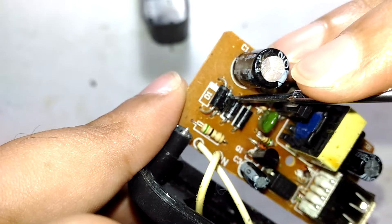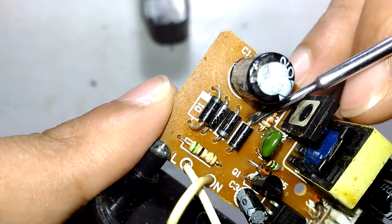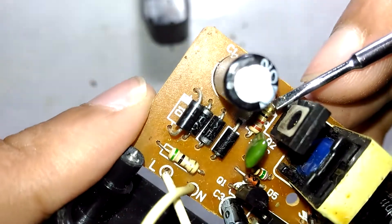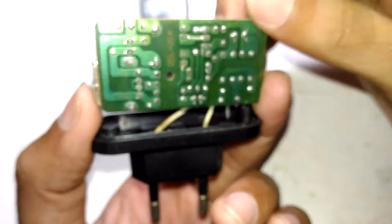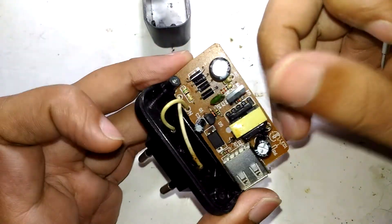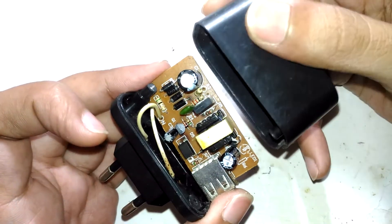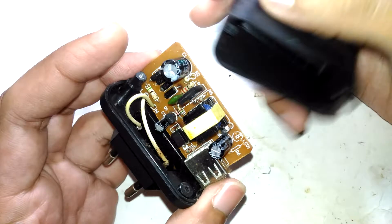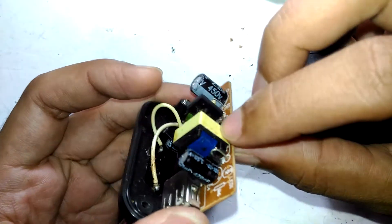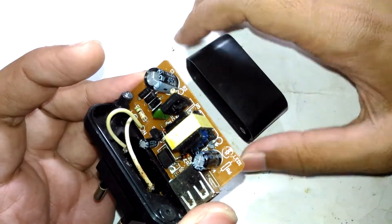There are some hot spots — see that browning right there? That's localized heating on that particular pin, probably from current draw. Overall, this thing is really good for an OEM charger, even though Kinsinder isn't a well-known brand. By the looks of the transformer size, it's actually rated for 500mA max. Let's test it.